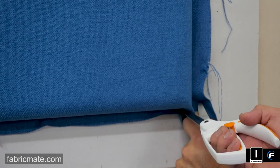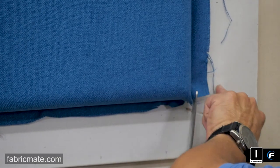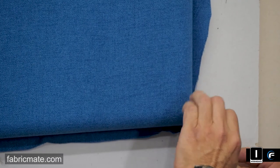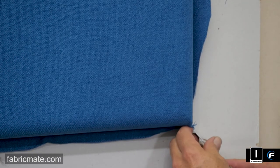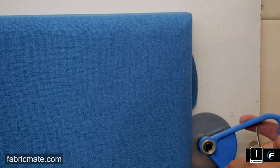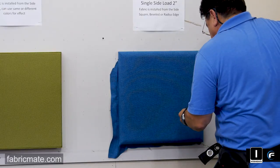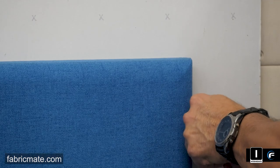It is a quick process once you get some of the technique down. Go ahead and cut away the bulk of fabric to get it out of your way, taking your time to pay attention. The fabric is rolled in and seated properly in the hidden channel at the back. The classic line square profile is inserted in the MaxLine extender. The extender is what brings these half-inch products out to the depth you're looking for — two-inch, four-inch, six-inch. You can see you're getting a nice one-inch radius, two-inch thick panel that's going to give you a lot of years of sound deadening.